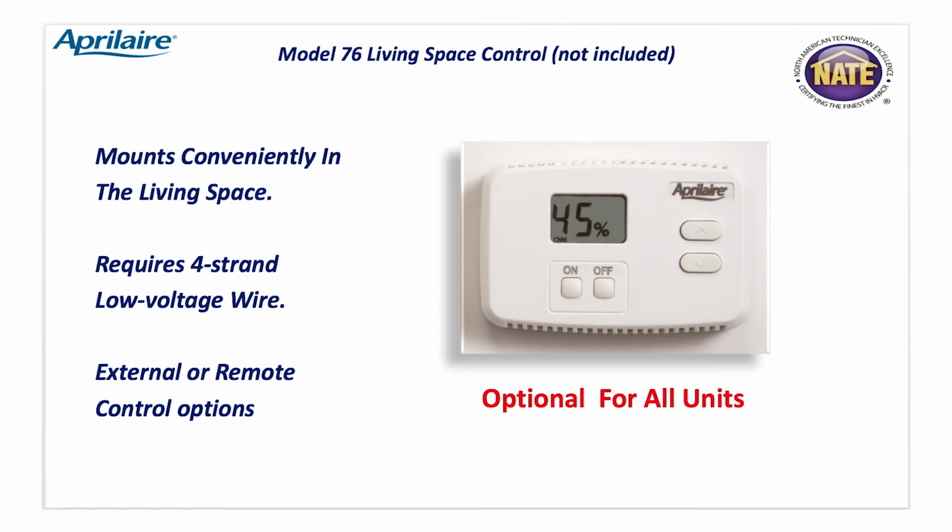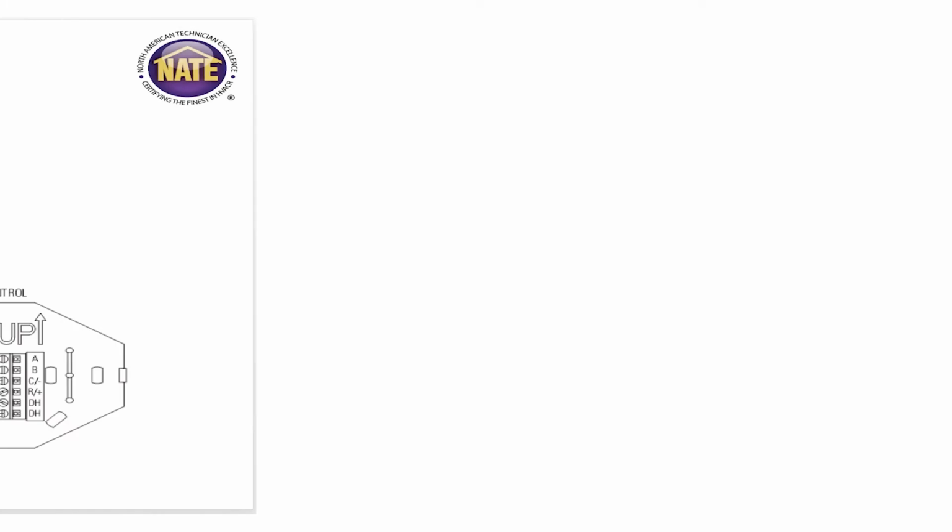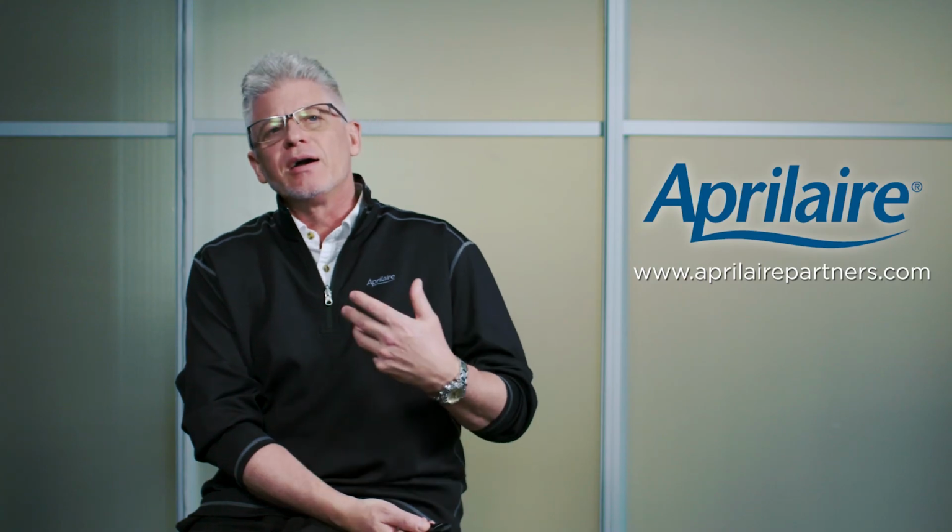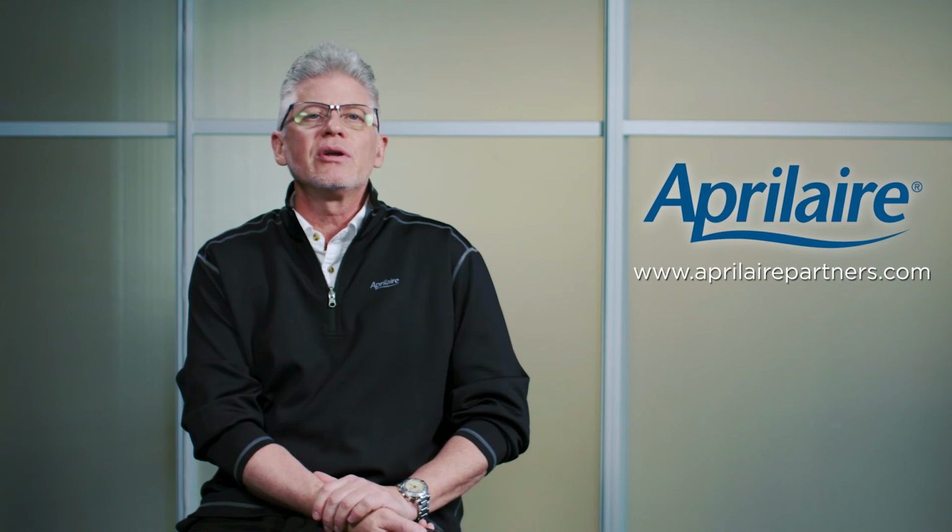This is the only product made that allows you to remotely or externally measure RH. So I could put this control on a wall and I could tell it to read the RH down at the unit, or I could tell it to read the RH right at the wall. So it's a pretty neat piece, simple to wire. It's just 4 easy wires, and this works with all of our 1830s, our 1850s, and our 1870s.